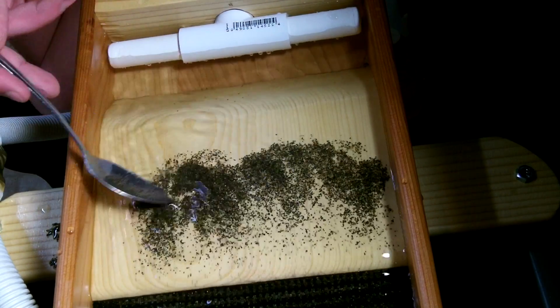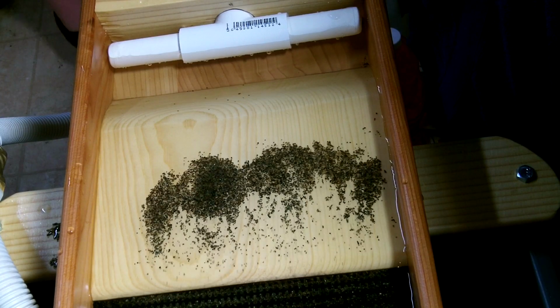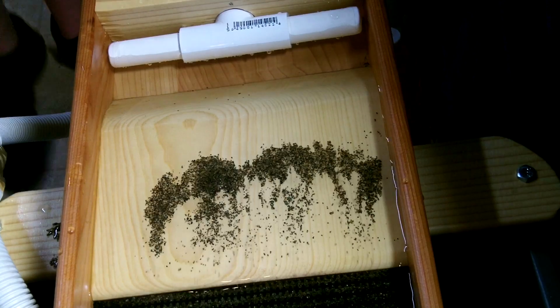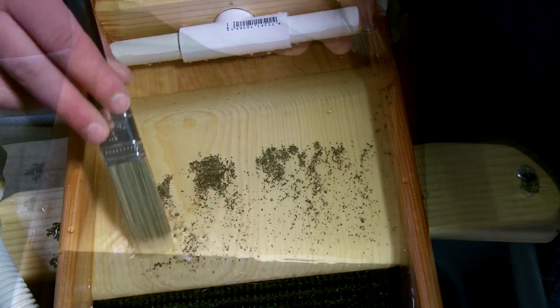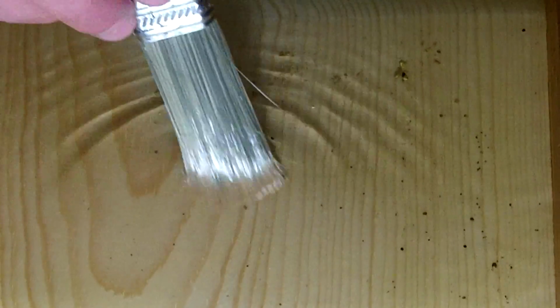While I was setting up my lights and camera so we could shoot some footage on it, my grandson started running material on it. And when I got finished up and started paying attention, I noticed he had the water level turned way down. So I asked him what was going on. And he says, well, I found out with the low water level that this acts just like a Miller table, and the gold is dropping out right on the slick plate.